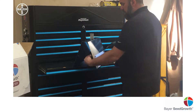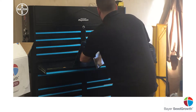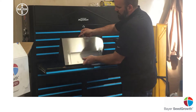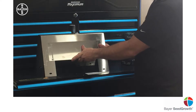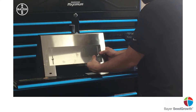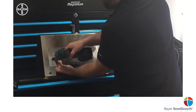Right here, all you're going to do is hold it with a wrench in the back and loosen these up. Now you just want to slide this up to about halfway — that's a good place to start. You can go all the way to the top if you want to go faster, but on an 8-inch auger that's probably going to be too much. So about halfway is a good place to start. Just hold it with your hand, reach out behind, and tighten it up.